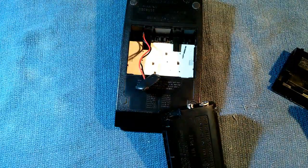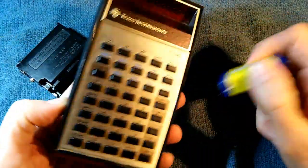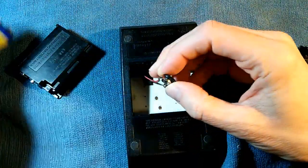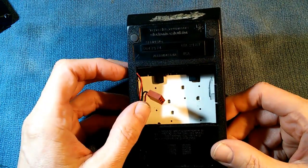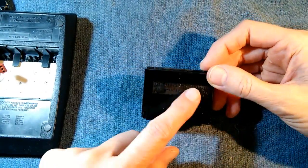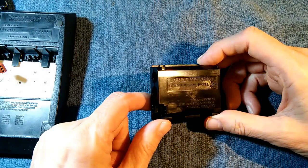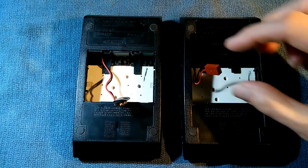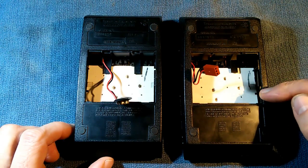The reason for this is so that the inexpensive TI-30 could also be run by an inexpensive 9-volt battery — one of the ways they reduced cost. So with the TI-30 you had the option of either an inexpensive 9-volt battery or a more expensive rechargeable battery pack. The 9-volt option is not available on the TI-55. Inside the battery pack, two rechargeable nickel-cadmium cells in series produce 2.4 volts, and a circuit board boosts that 2.4 volt DC signal up to 9 volts. It is possible to replace the proprietary three-pin connector with a standard 9-volt connector and run the TI-55 off a 9-volt battery.